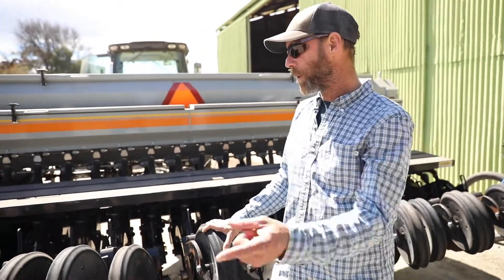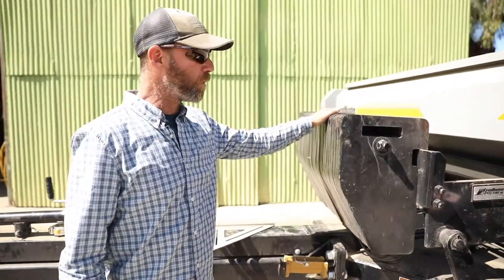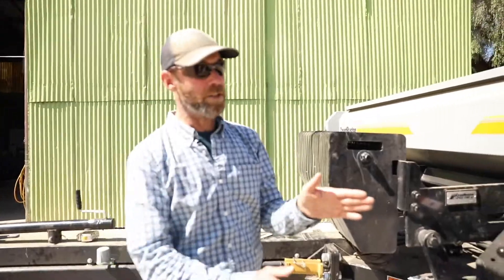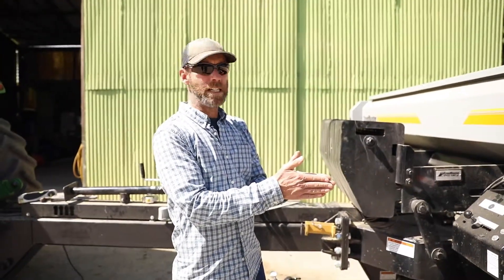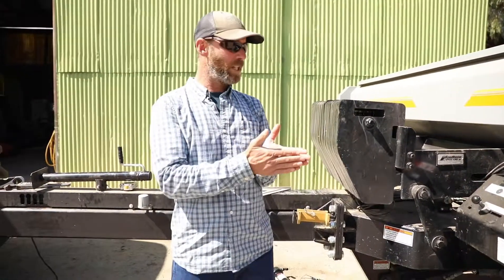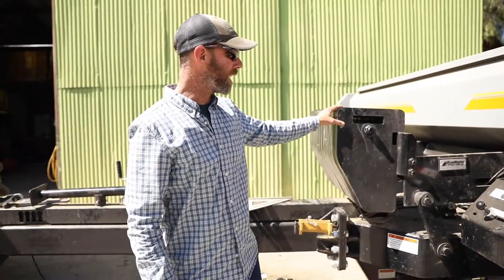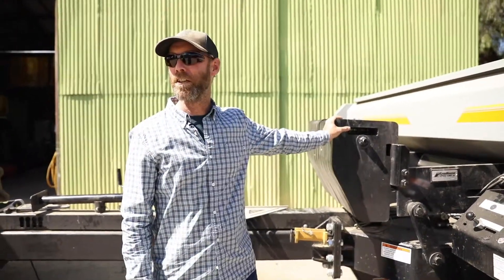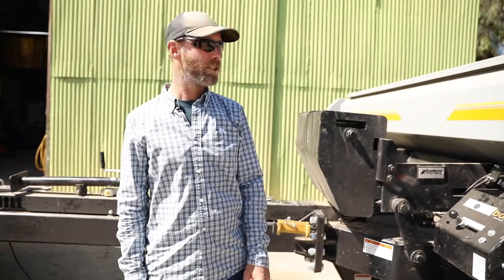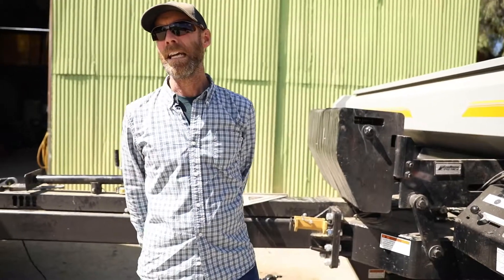On the other side, this machine has a bunch of weights on the front. Between those added weights and the weight of the machine itself, that comes to 500 pounds for each seeder unit — so every double disc opener can have the equivalent of 500 pounds of pressure on it. That allows it to go through really tough soil. We can adjust that by removing weight, and we can also adjust it by how we set the planter depths. Those are the main things working in our favor: the weight and the right cutter.